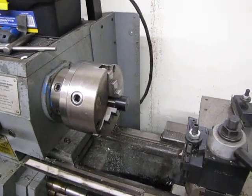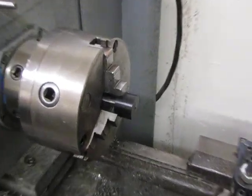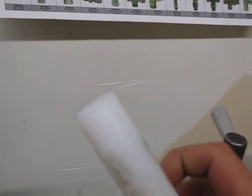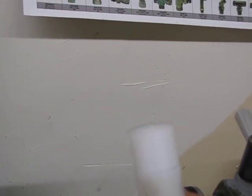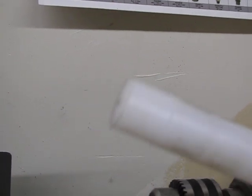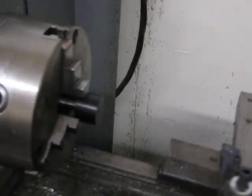I just want to show the difference between machining black Delrin, or any Delrin for that matter, versus UHMW, which is this stuff right here. The UHMW tends to gum up while you're trying to lathe it, and usually you need a lot of coolant to actually machine it properly so you get a nice smooth surface, as compared to the Delrin.